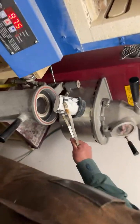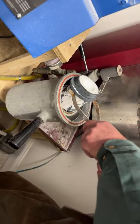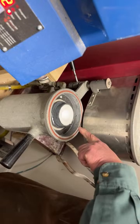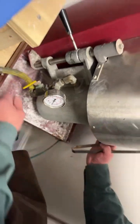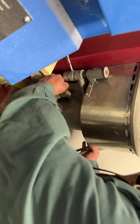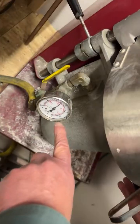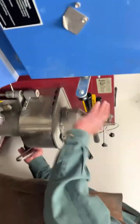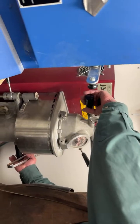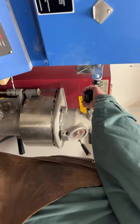I'm going to tip this upside down and drop it in. See the hole? That hole is where the wax was and it dripped out. Now the vacuum is pulling up pressure. And we're going to release the gold. I'm going to pull this handle, the gold's going to shoot in. Here we go. 1, 2, 3. Then inject. Pretty quick.